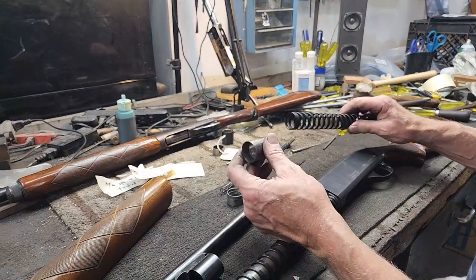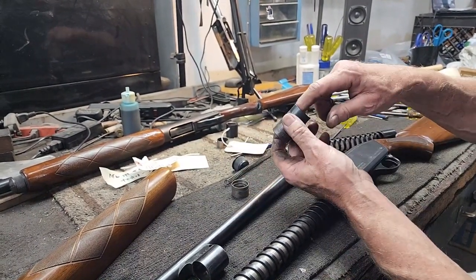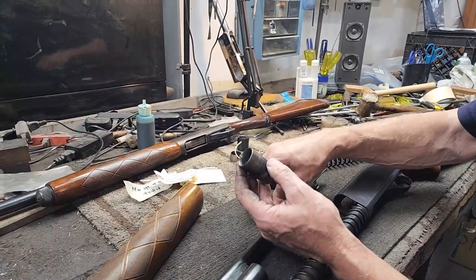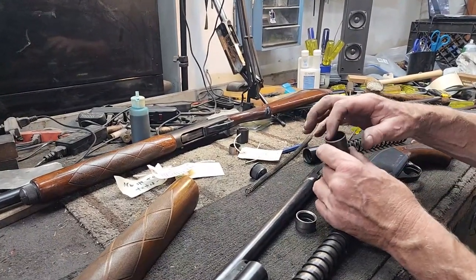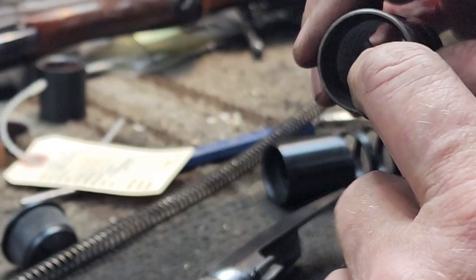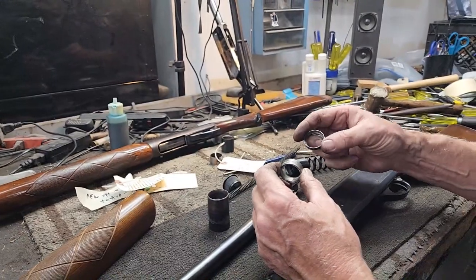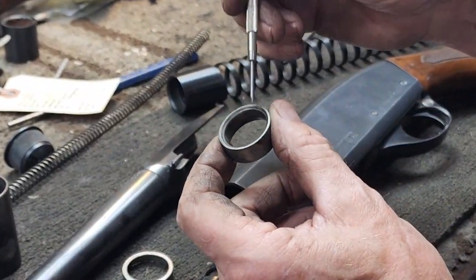There are several different kinds of collars. Some of the early ones had a collar that was actually kind of threaded inside and your spring went in and kind of wound into those threads. We don't do that anymore. Here's another style they went to and this really works well - it's a lot simpler. Everything depends on this bevel that's cut in here as to how it slows down the travel of that barrel when it's cycling. This is one angle and it's just kind of made to shoot everything. They went to a little different system that's a lot simpler, and I like it - I'm going to make these rings up. There's more of a taper on one side, and flipped over there's less of an angle.